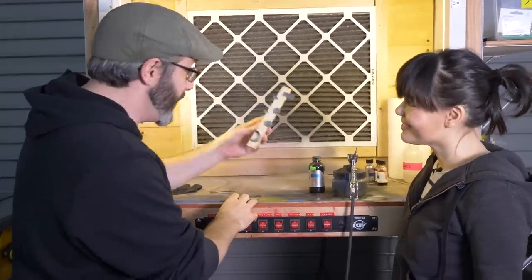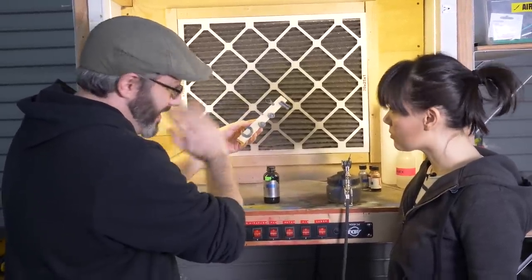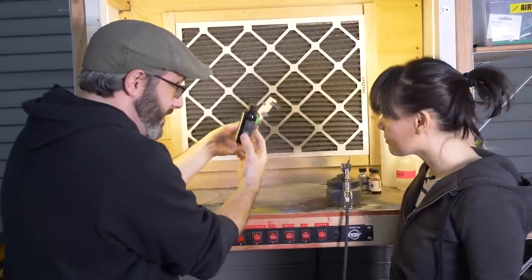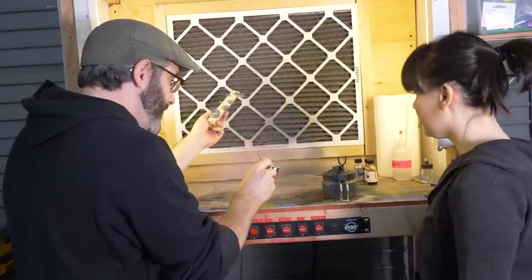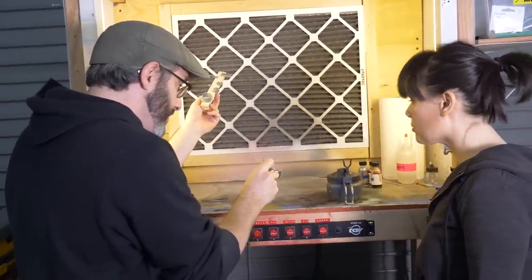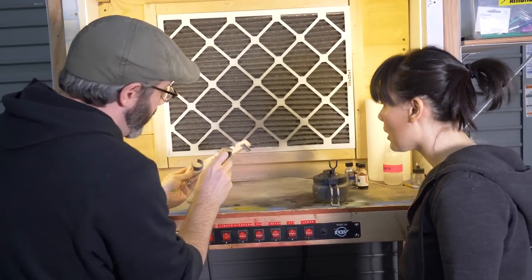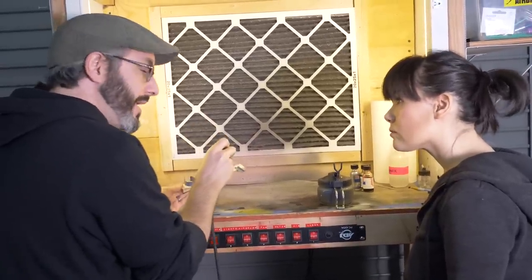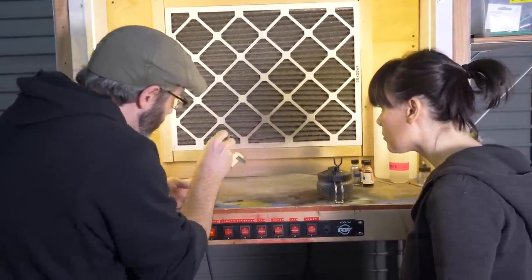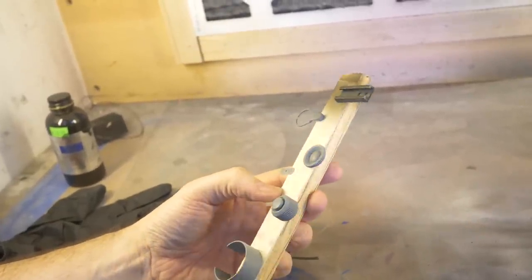It is time for our first round of paint. We're going with a gloss black. And then we're gonna put a metallic coat over that. The gloss black is this lacquer, Alclad lacquer. Okay. Already loaded up in the airbrush. Sweet. And about 20 PSI on the compressor. And then all we have to do is cover these parts with black paint. Okay. And you can do two passes, like a lighter dust coat and then a wet coat afterwards. We'll probably do that. So that's just a light dust coat. We'll do that first.